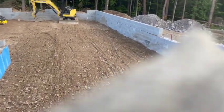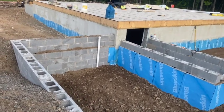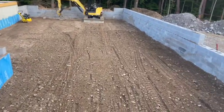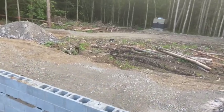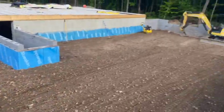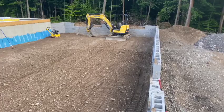Okay guys, here's the progress on the Stone Road project. We are filling in this huge garage — it's 32 by 64 feet and it's nine courses on the concrete block part. Over here is Nudura and concrete block for the porch. We filled the porch in already. Everything started way low here, so we've got to fill all this in. You can see how low it is on the outside — all that's got to be filled in up to these doorways. You can see the garage doors over here. We've already done three courses and we've got four more to do.